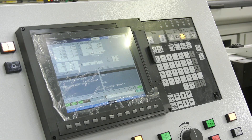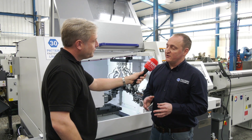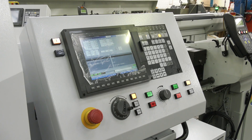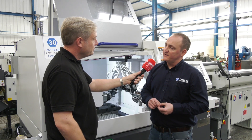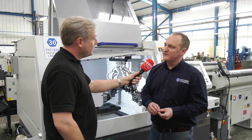And control-wise - the machine is so new you've still got the plastic sheet on the screen - but Mitsubishi? Yeah, Mitsubishi control, additional functionality, but what I will say is it's not lost the familiarisation that the old machines have. So you can take an operator from a machine that's 20 years old and really within a few minutes you'd be familiar with the screens on this machine, so that's very good. What about actually using the LFV in terms of controls - is that easy, because 12 months ago it was a new process to you? Fairly straightforward really. You just set a G-code, number of variables, switch it on, switch it off. You've just got to set the numbers to match the material you're cutting to get the material to chip. That takes a little bit of experience but we seem to have got that now.